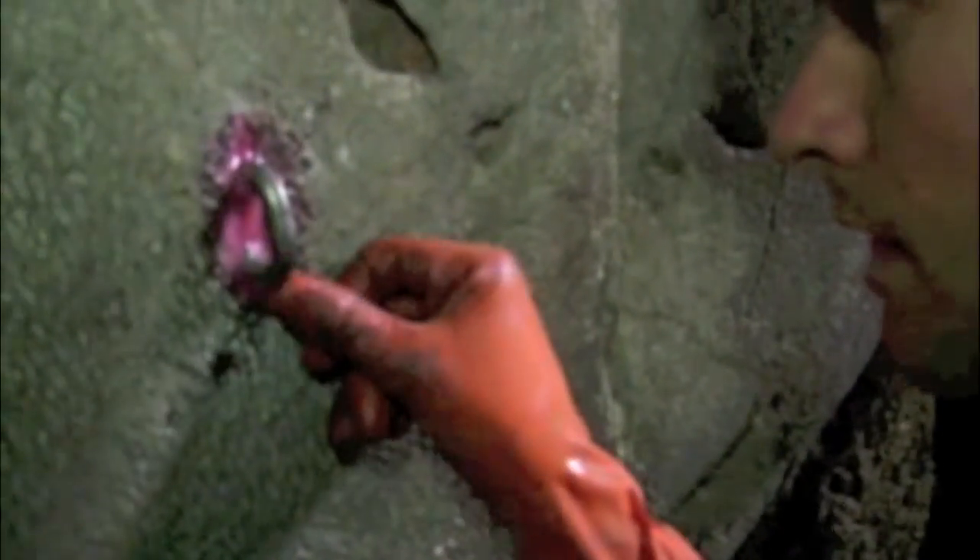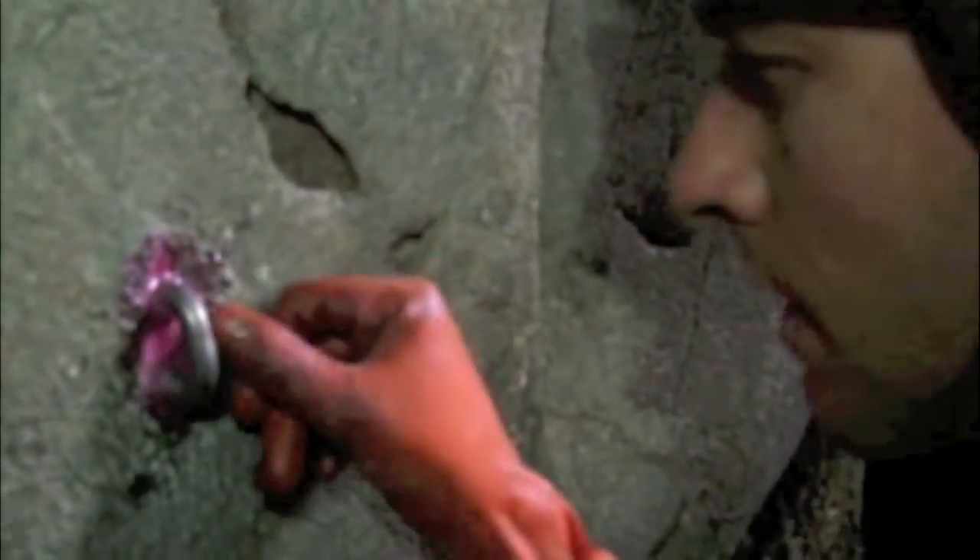Smear the excess resin around so it's just nice and full. This is where the rag comes in handy — we don't want to leave it like that, it's messy. Now, whilst this gap is sufficiently large to accommodate a carabiner, it's a bit awkward sometimes to get your finger in there to smooth the resin off. So either use a spatula, a tube, the extension tubing, or a bit of wire — any sort of implement like that is useful to get the resin spread right in the back if it's not quite evenly spread. You want to end up with the anchor, once finally installed, with the glue nice and evenly spread over the head. And that's it.